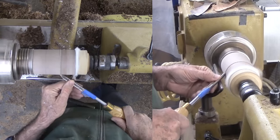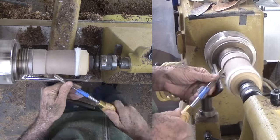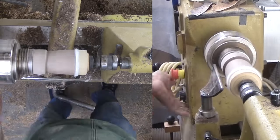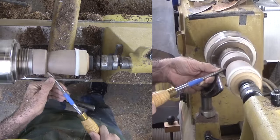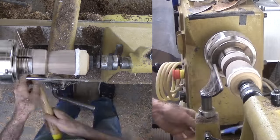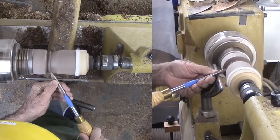I have a faceplate on my threaded live center to support the wood. I've seen others use all kinds of support here, including a tennis ball. However, I like this approach since I do have a threaded live center. Without some support here, the wood would vibrate more and quite possibly mimic a UFO — neither is acceptable. I frequently stop the lathe and check wall thickness with my finger calipers before moving on. Why not at least one check with official calipers?